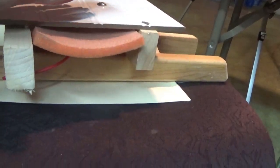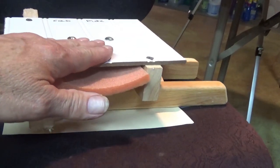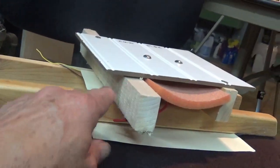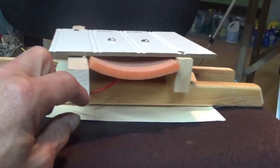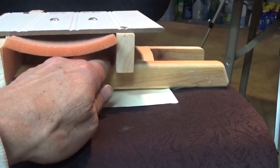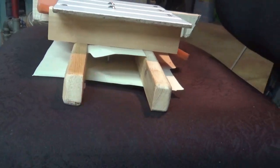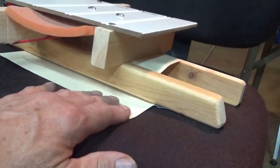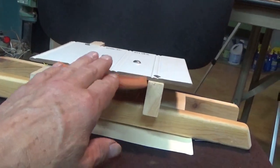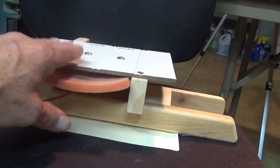Okay, so obviously this would be a piece of metal, a cold plate, and probably need some type of thin cushion, but it shouldn't be a thermal resistance because then it won't do its job of cooling. And then it has this lattice here of 1.5 inch pieces. And what would happen is the ambient air would come in this way and would exit out this way. And there's a baffle on the bottom, there's a baffle in the middle to separate the hot air exiting from the ambient air coming in. There's insulation to separate ambient air from probably a 60 degree or 55 degree cold plate on top.